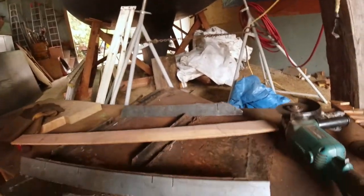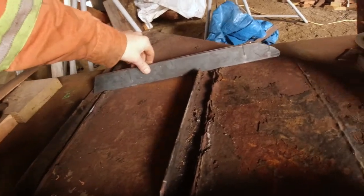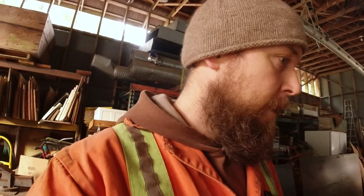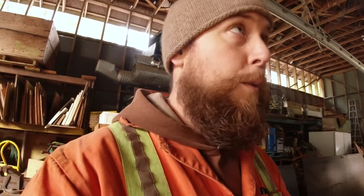I've got this one and this one, and they both fit pretty well, so they're just about ready to weld up and then cut the ends back to the proper shape. I'll have to fit them in there with some straight edges and make sure that it's all going to be nice when I fit the plate.